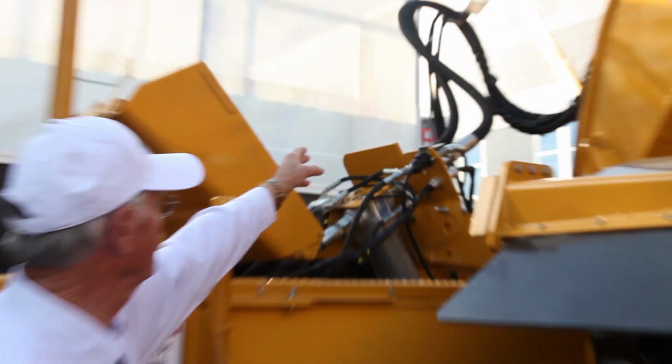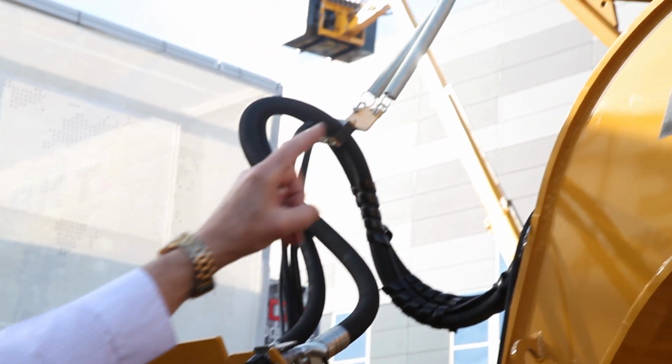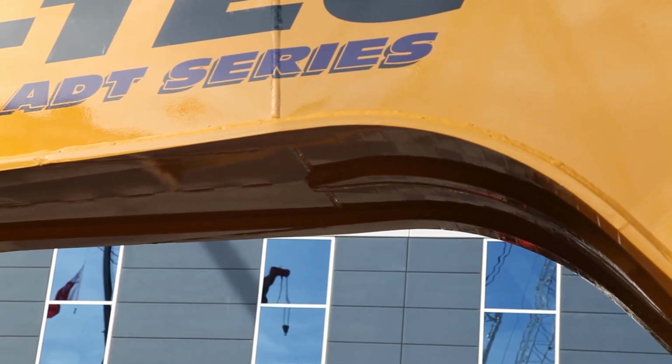After it leaves here, it goes up the hoses and over the top, and we got an accumulator up on the top that I mentioned a while ago about the 2 lift cylinders that's mounted on top, and comes right straight back down in here to a junction point where the hydraulic oil goes to all the different cylinders.